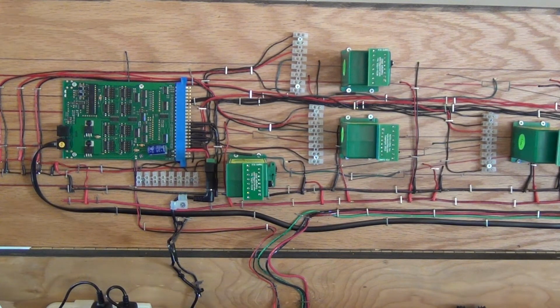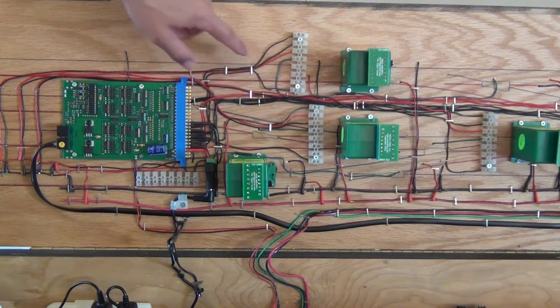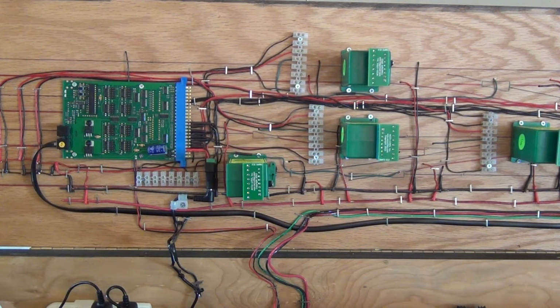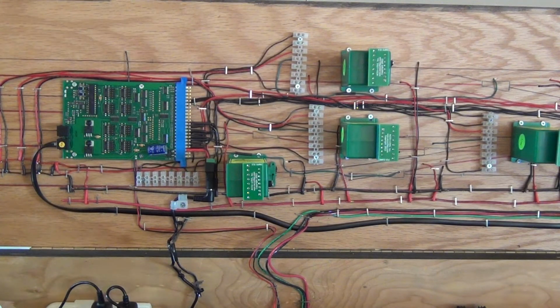and then 5, 6, and 7 are going to be wires that are going to power some LEDs on the front fascia. So I'm actually going to do a yellow wire in, which is going to be position 5, and then white wires out 6 and 7. And I'll show you what I'm going to do with that later, because I still have to run the wires up to the input on the terminal strip.